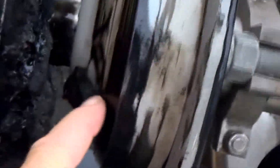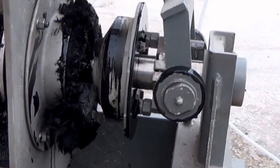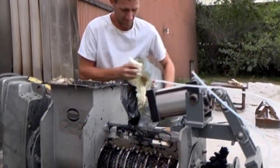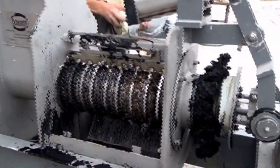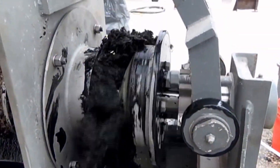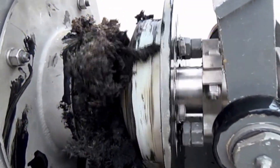We open the cone — there are stripper pins. There we go, stripper pin right there — probably helps in this application, probably not strictly necessary. We're pushing in styrofoam at this point; we always use styrofoam to clean out the press. Probably would have worked better on the alfalfa — well, that wasn't alfalfa, those were cottonseed hulls being pressed right through the screen. We're still pressing out press cake. There's some dry stuff, and now I see cottonseed hulls still mixed in.